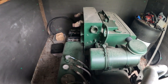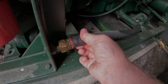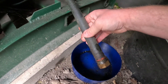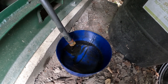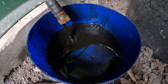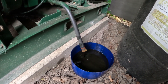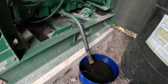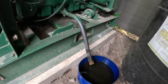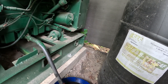We're good — temperature's up, the air vents are open. It is rather toasty and smoky in there, so we're going to let it clear out a bit and go ahead and get this oil drained while it's nice and hot. This oil doesn't have a whole lot of run time on it — probably 20–30 hours or so. It's pretty clean, but it's been two years since we mounted this and serviced it out, so I want to go ahead and service it again, clean everything up, and get this filter canister swapped over.